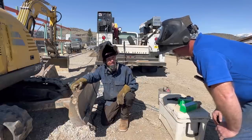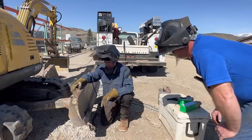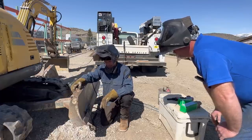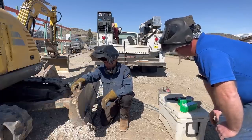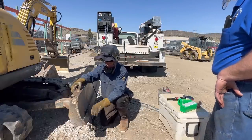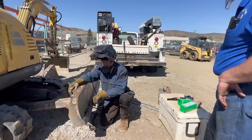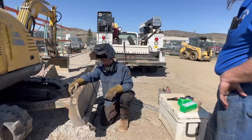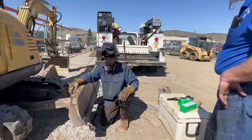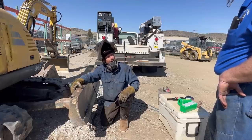Technique with this thing, but yeah, that's the technique there. That looks almost identical to a carbon arc gouge, but with a little bit of slag, pretty minimal slag. And for that to come off like with my hand like that, but I think that's the technique right there. That, and then I'm not cutting into the blade now. I'm only really cutting through the weld and the cutting edge. But I know a welder, so we should be able to get any undercut I got in there out.